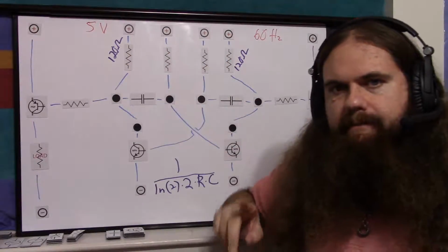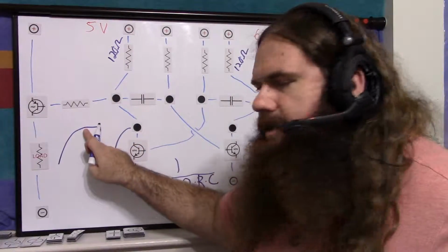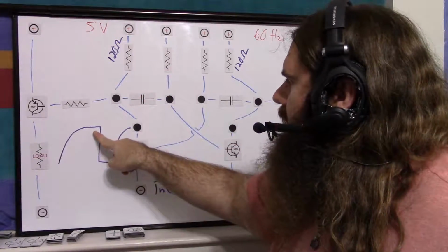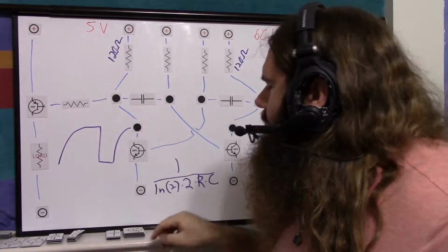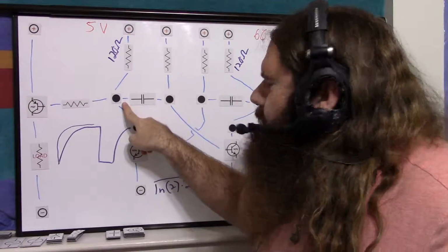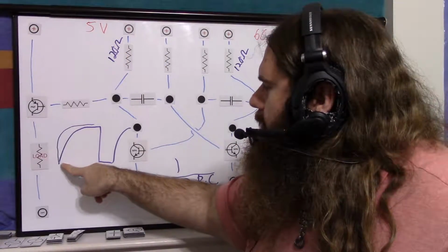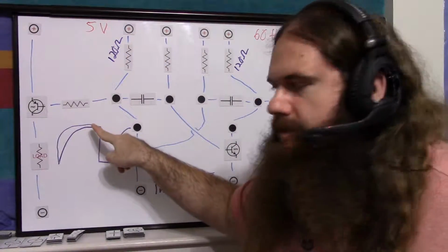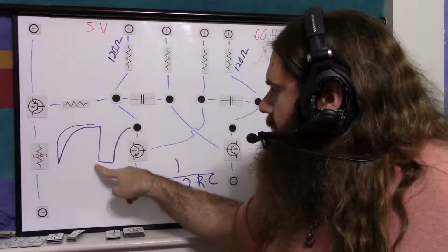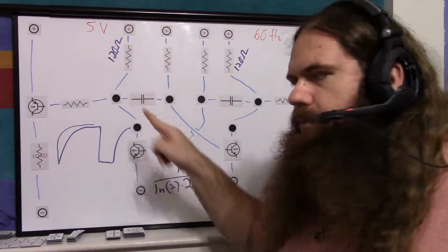And recall in addition that an oscillator is supposed to give you more of a curve like this, where there's kind of a ramp up, because as the capacitor charges, it goes from low to high and then stays high for however long, right? And we want this to be sharper, really. You know, having this resistor smaller will make it sharper. But when this is sitting charged at around the power supply voltage, the load is off. So it charges up and then the load turns off as it charges, and the load is sitting off, and then it immediately dives down when the capacitor is discharging, and as it's sitting down here at zero, the load is on, because the zero is coming from the throughput of the transistor.